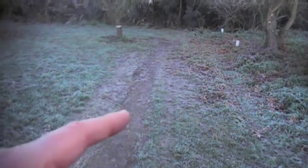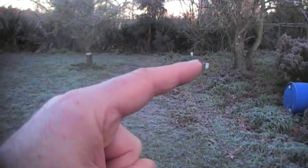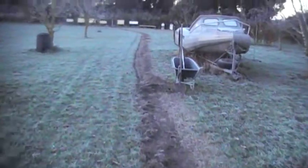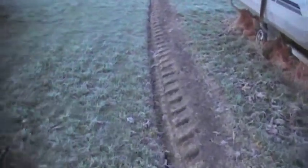Well, there's actually 2 wires run this way. I didn't tee it. There's no join here. One wire goes that way, one wire goes that way. So there's 2.5mm copper wire goes across here to about that point, and then through in between those white pegs, and that's where I'm going to build a glass house this next summer. So I wanted some power on there to switch water and all that sort of stuff. Much easier than running 12 volt or batteries. Well, I was doing it anyway. And then the other trench goes along to here, and then heads down. I haven't backfilled all this yet. It takes me a long time with my crappy back.